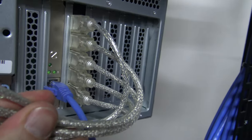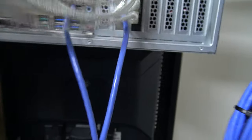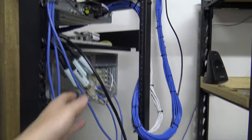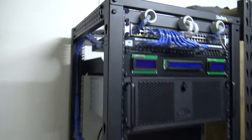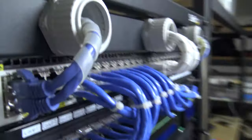From the RF amp it gets split, and then feeds these five TV cards which go into the USB card — so that leaves my ports on the motherboard free. These two here are the two network devices: one for the main network, one for video basically, so the video one that goes all the time doesn't swamp the main network one. The rest is just the modem, Raspberry Pi, and the switch. The extra single Cat5 at the back is just what goes to the computer on the workbench.